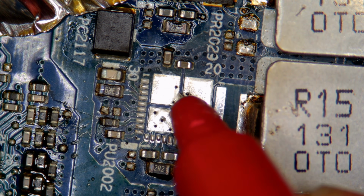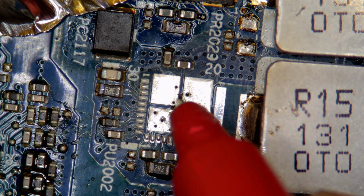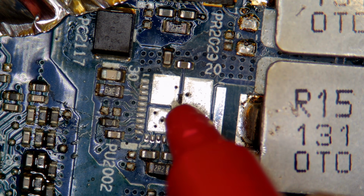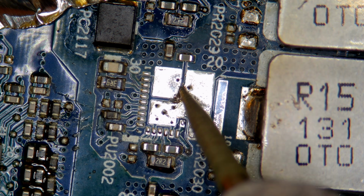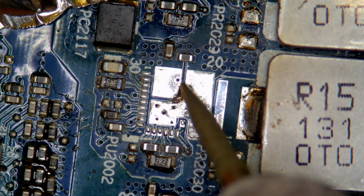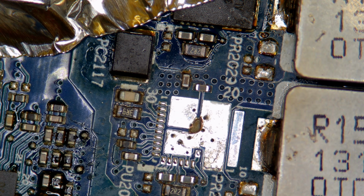Unfortunately, the audio doesn't work from my microscope footage, so I'll just have to narrate over it. But as you can see, we do have a PCB layer short just under the power stage. I'm a bit surprised. I'm actually kind of embarrassed that I missed it to begin with, but at the very least, we did catch it. So as you can imagine, I have to drill into the board, and that's the finished product.